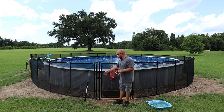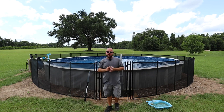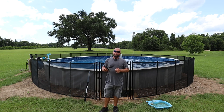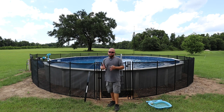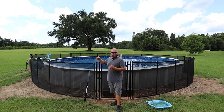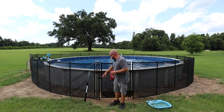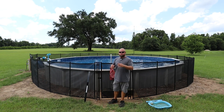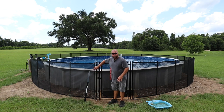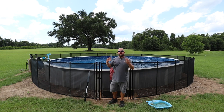The other very important requirement is for your gate latch. This is a very basic latch that just slides down in. The Florida Building Code states that your latch must be 48 inches high, whereas an additional government safety agency rule I'm seeing here in Florida — which not all local municipalities require you to follow — states that a latch should be 54 inches high. That just makes no sense to me because it's got a 48-inch fence requirement. However, there's an exception to that rule: this latch is on the backhand side behind the gate, and the rule states that as long as there's not more than a half-inch gap and you're covered by 18 inches around, that is an exception to the rule.